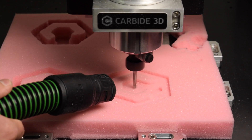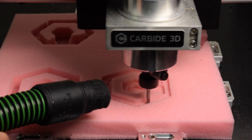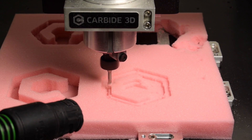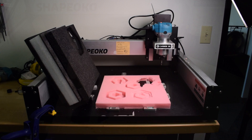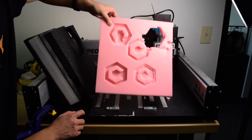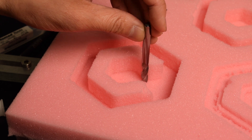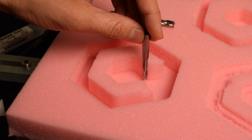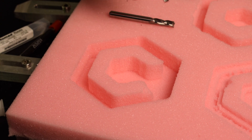The last thing I want to talk about is soft foam, like the pink anti-static polyurethane. This was the most difficult foam to machine because of how soft it was. Even cutting it with a conventional toolpath, the deflection of internal features was enough for the foam to get snagged by the cutter - usually it would just tear a chunk out of my stock, but during one test I had the whole piece rip off the table and wrap itself around the end mill, which was super scary. This is where the Datron foam cutter, which is actually specialized for polyurethane, really stood out - because it's a stub-flute cutter. Only the bottom of the cutter will grab at the foam. A longer fluted end mill will cause a little foam deflection at cutting depth, which will cause more foam deflection above it, which will snag on a taller section of the cutter and cause more deflection - it's a catastrophic chain reaction that's solved by putting flutes only where you want to cut.